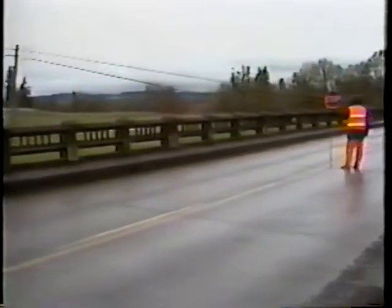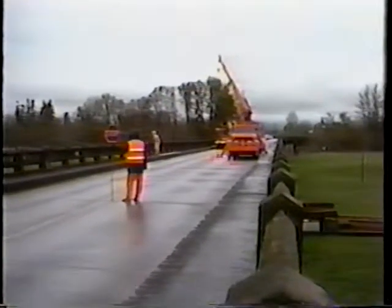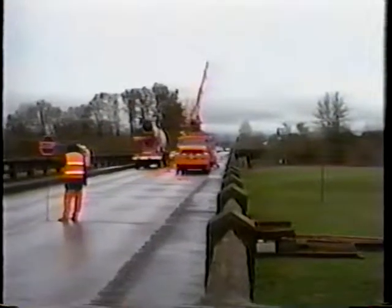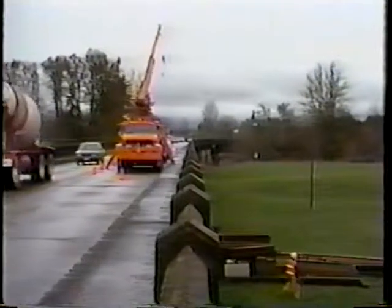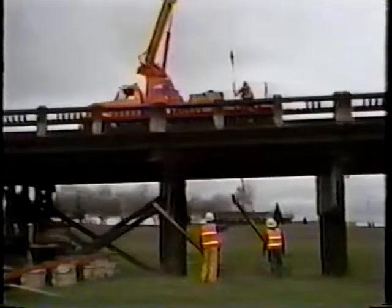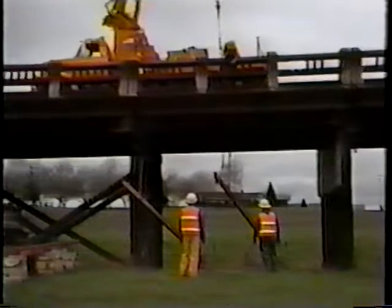In order to change the pile caps on the Whiteson Bridge, the Salem 22 bridge crew has several goals: to work efficiently, safely, and not impede the flow of traffic over the bridge. To do this, they will be setting staging under the bridge to jack and hold the bridge deck up while they remove and replace the pile caps. This will be done while traffic continues to use the bridge, with most motorists unaware of what is happening below them.